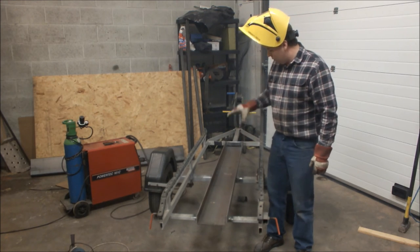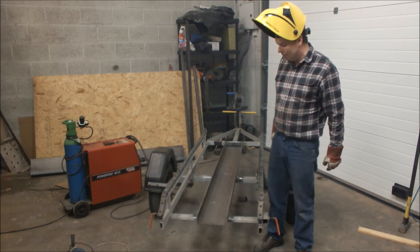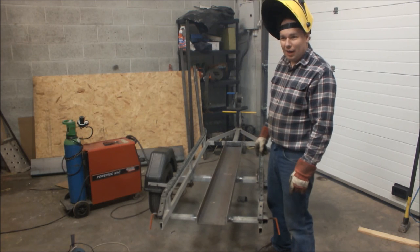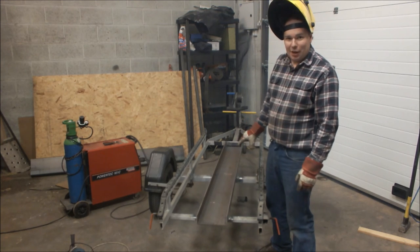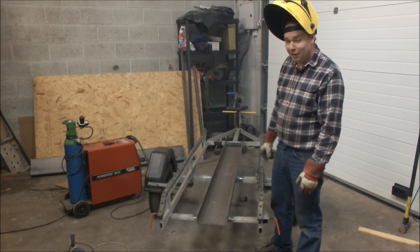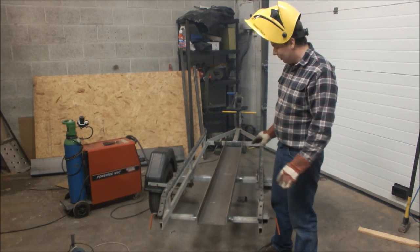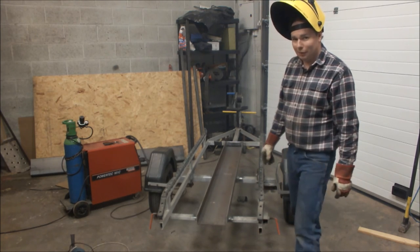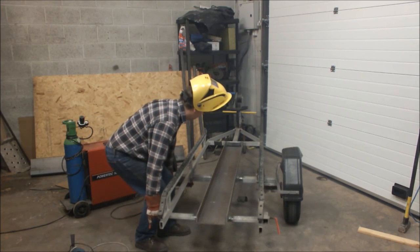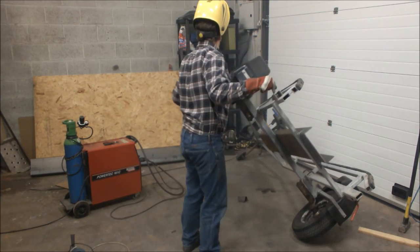OK, that's got all the different points on the top of it welded down. So I'm going to tip the trailer on its side now and weld everything underneath, make sure we're nice and strong. There were a few places there where even though all that time was spent grinding off the galv, we're still finding it. So it just goes to show you've really got to try and try again - you've got to really get it off, so it takes a while. I'm going to tip it on its side now - it's not very heavy - just a case of doing this without ruining the door.